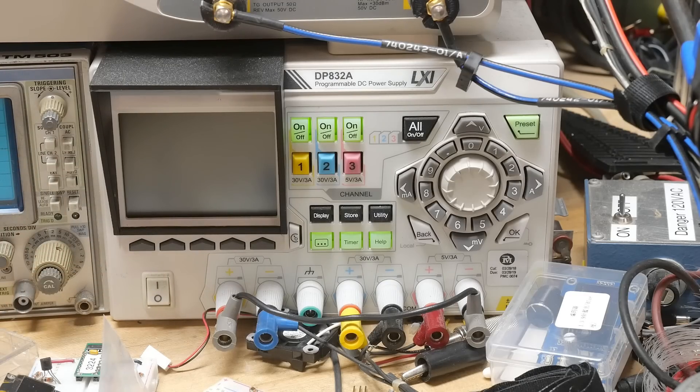But remember, it's the display. Let me turn it on — it's got a vacuum fluorescent display, which is just perfect. You can see the numbers really nicely. When I go to set something, I'll do a V-set — it's the same number. Turn this off, it goes to zero volts, but when I hit V-set it shows it's set to 12.5. Then I-set shows one amp. And of course those are all adjustable.